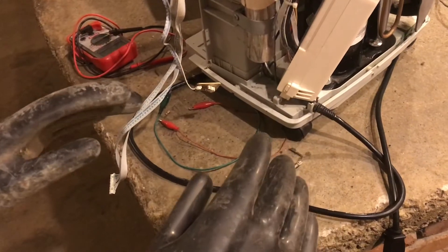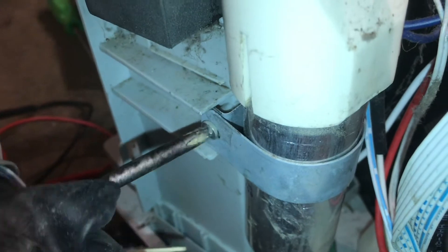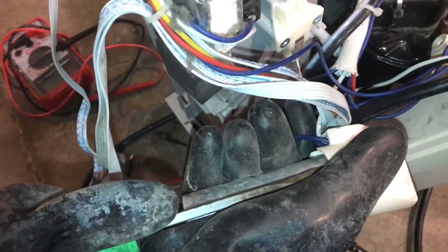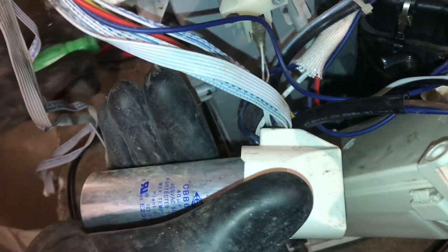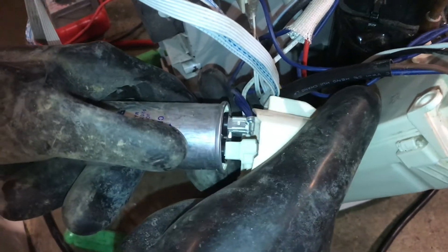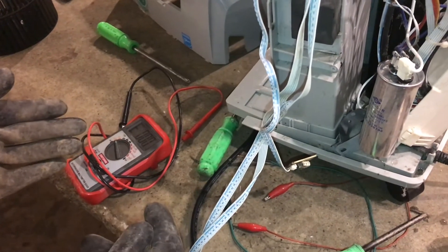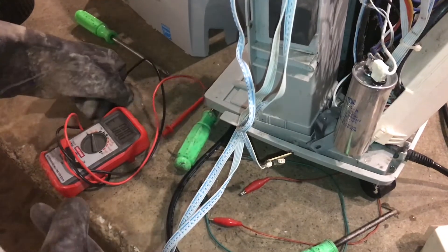It's not a bad idea to wear rubber gloves. I'm going to start by removing the strap holding the capacitor in. There are some tabs keeping the plastic top on, so I'm just going to carefully get one tab off and then the whole thing comes off. Now before I discharge it, I am going to check the voltage just to see if our discharging has any effect.